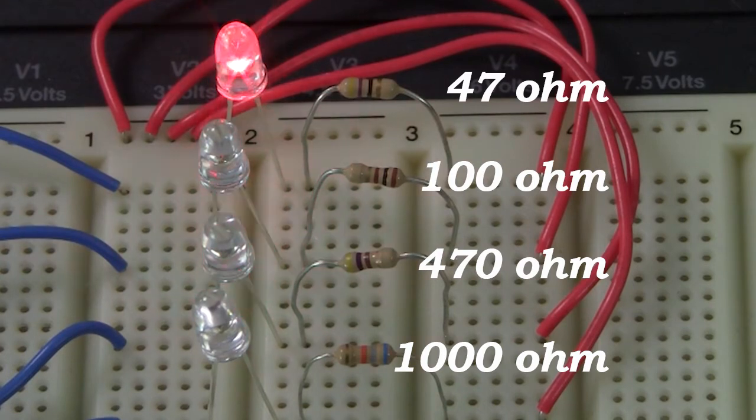In reality, you're not going to find a 20 ohm resistor — they don't make them. But you can get a 22 ohm resistor. Furthermore, you should be aware that there's a pretty big fudge factor in both the design of the LED and the resistor. Resistors come with color bands that indicate their tolerance. The inexpensive resistors that I'm using in these circuits have a tolerance of plus or minus 10%. As a practical example, I have a simple test circuit set up with four different resistors. I have a 3.1 volt power supply, and a 47 ohm, 100 ohm, 470 ohm, and 1 kilohm resistor.